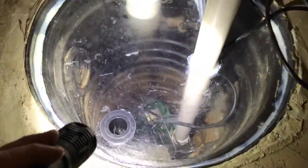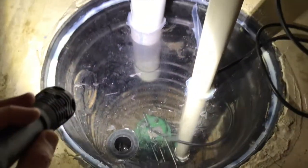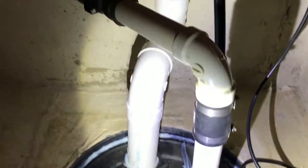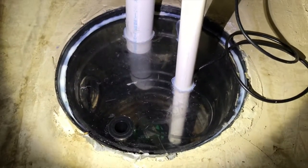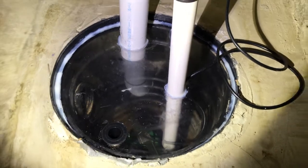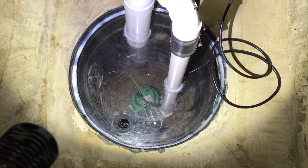That little circle is a safety valve. In the event that water gathers on the top portion of this cap — whether from a leak from any portion of the plumbing or the water heater close by — water will go into that hole. Once the pressure from the water rests on the lower portion of the valve, it will open and the water will fall inside the sump area. However, if there is no water on top, it is spring-loaded up to create the airtight seal, ultimately not allowing any radon gases to escape. So we will always be able to look down inside our sump chamber to see what's going on.